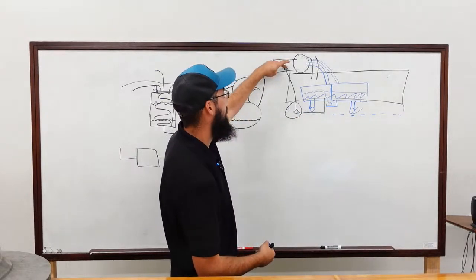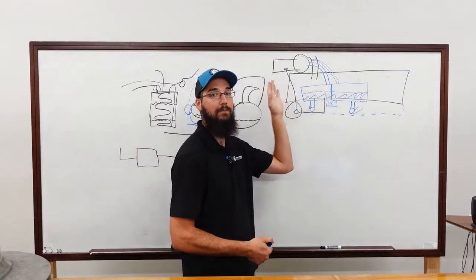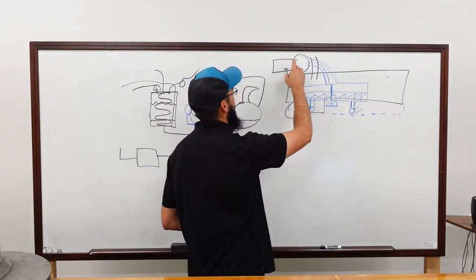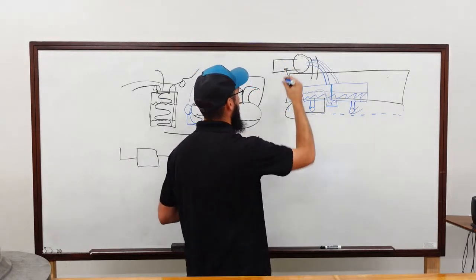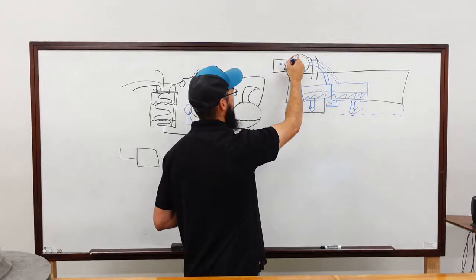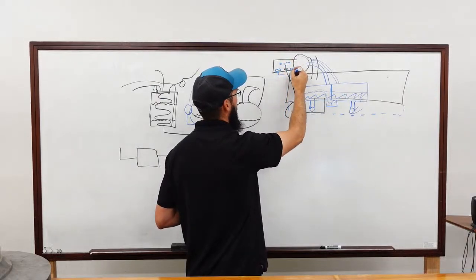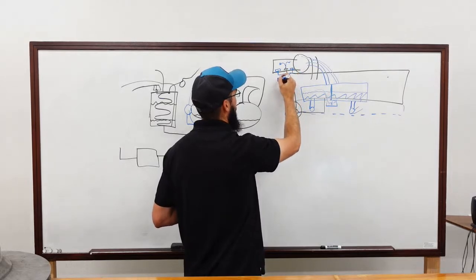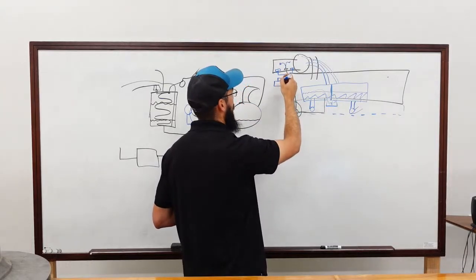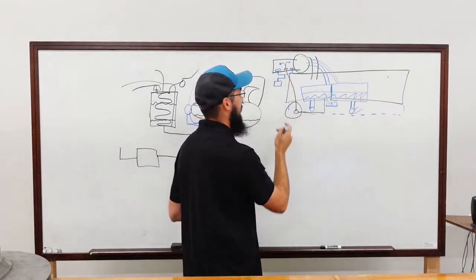But I've seen all kinds of pictures and different scenarios guys have run into where that orifice plate will plug up, stop up, and just cause all kinds of havoc. It's pretty interesting. Anyway, from there, you've got your low side. So the refrigerant shoots in and distributes; the motor is spinning, so it's got a lot of turbulence in there. And then it comes out of two ports on either side. And these will come down and Y together. These then feed into a separator. So when these feed into the separator, this is also what allows your oil to drain back.